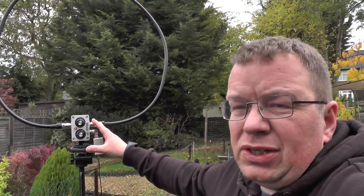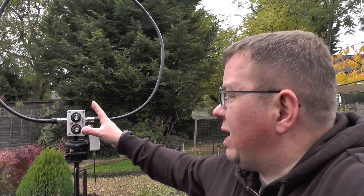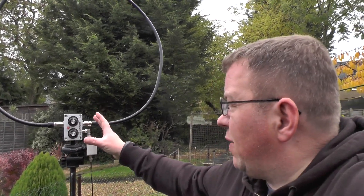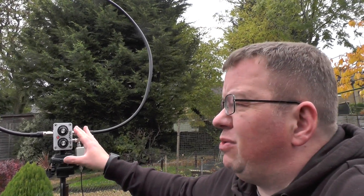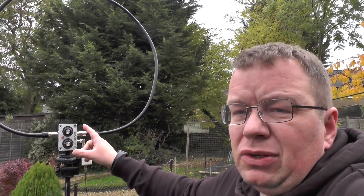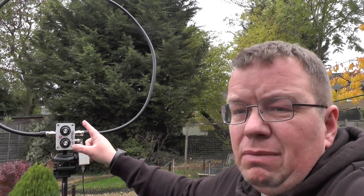The first video I did with this, it said it wasn't great. I had trouble getting the SWR coming down. I've seen Fred do his video and he adjusted the capacitors inside to get it to come down onto 27 megs. Now the specs on this say it's 5 to 30 megs, but some eBay listings say that it does UHF and VHF.